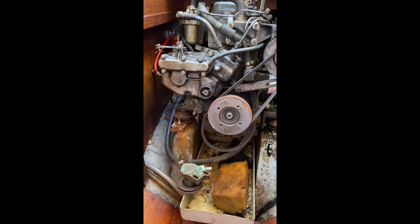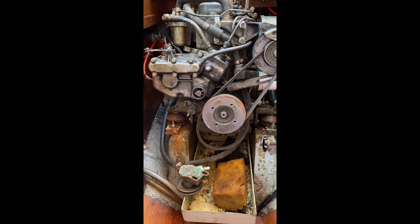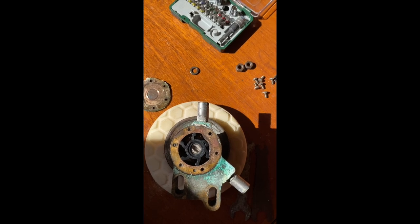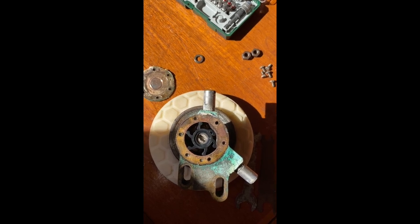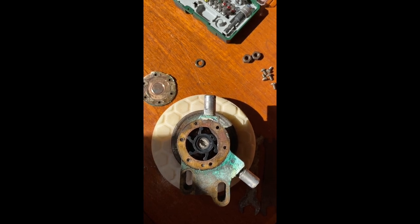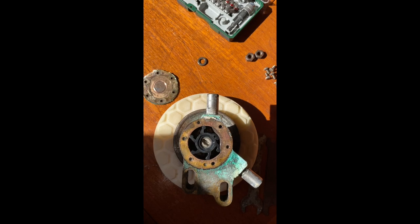This engine is from the late 70s to 1980s/90s. As I suspected, the impeller is fine - it's just the inlet which is a bit crusted up, which is why it doesn't quite get enough water all the time. I think I might change the impeller anyway - let me check; I've got plenty of spares, just not quite sure if I've got the right one.